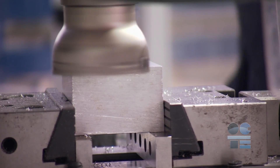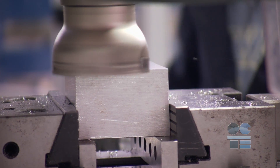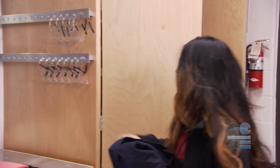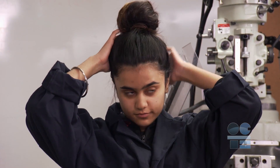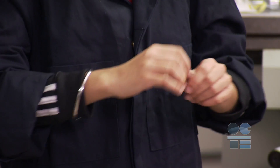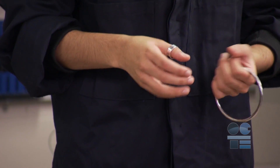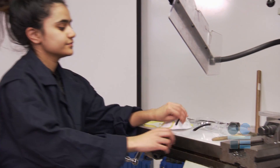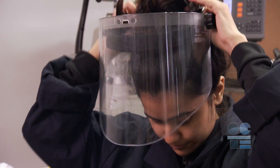You can safely machine a surface with the milling machine when you wear proper appropriate personal protective equipment, or PPE, and by following the recommended safety procedures. You must tie any long hair back and tuck loose clothing in to prevent being pulled into the machine. Do not wear rings or jewelry as they can also get caught in the machine. You must always protect your eyes while in the shop. Wear safety glasses or face shields at all times.